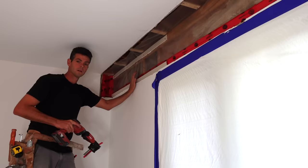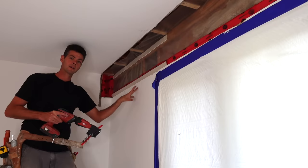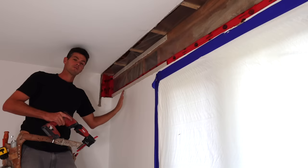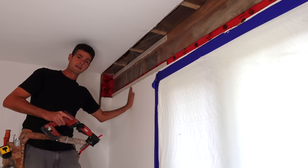The two most important things — and this applies to any tying-into-plaster job — are: firstly, you've got to make sure that everything is sound, which will totally vary depending on the job. This job didn't require much to make the original plaster sound because it was in good shape. But the second thing, and this is the most important when it comes to how flat your walls are, is you want to get your shims as close as possible to making the drywall totally flush. I'm going to be plus or minus about a sixteenth all the way along because plaster isn't necessarily uniform — it's applied by hand. This quarter-inch shim is going to bring my half-inch drywall out to basically flush, plus or minus a sixteenth, which will get evened out in the pre-fill.